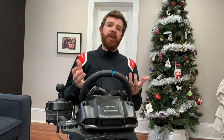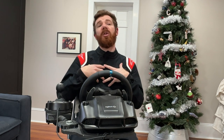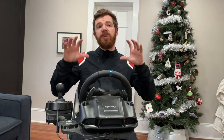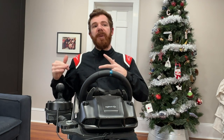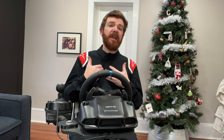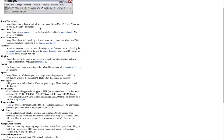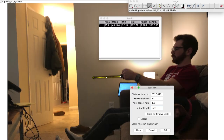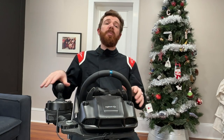The first thing I had to do was come up with some measurements, and it was really important that this entire simulator is adjustable — not just fit for me, so I could always open it and adjust it to somebody with a different build. Getting measurements of my driving position was a little difficult, so I actually used ImageJ, a pretty simple program that allows you to take measurements based on a photograph if you create some type of scale. I held a tape measure in my hand that I knew was exactly 12 inches, and then in ImageJ I could measure lengths and angles to come up with a good starting point for the simulator.